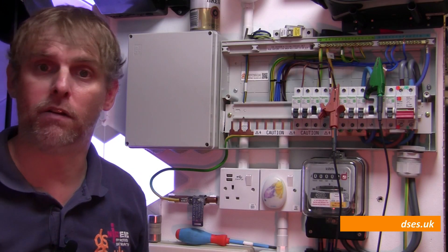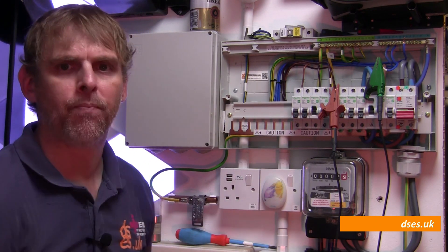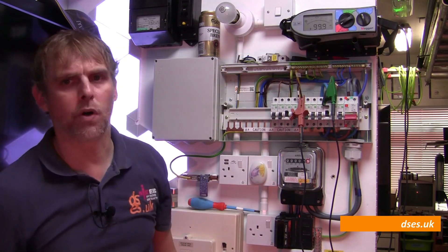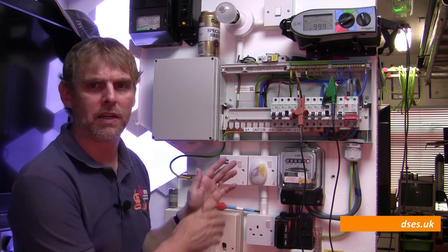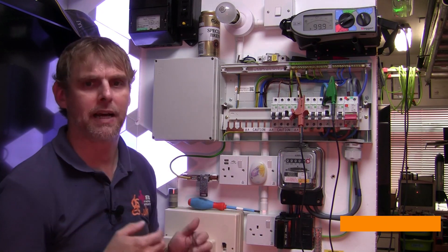We've got a missed load here and we'll see how that affects things when we put the tester on there. As we're testing first between line and neutral on this ring circuit, the tester is going to bung the test voltage down the wires and into this load. If we're not sure whether there's any load still connected, one thing we can do first is switch the tester into continuity mode to see if there's a resistive load between line and neutral, such as you'd get with an incandescent light bulb. If you're picking up a resistive load, there's no point proceeding with an IR test — it's just going to come out as a big fat zero.